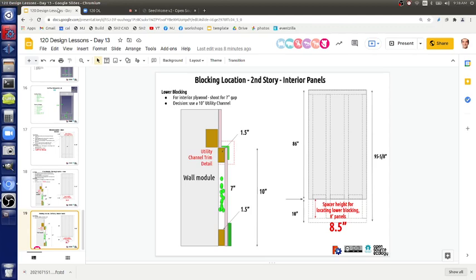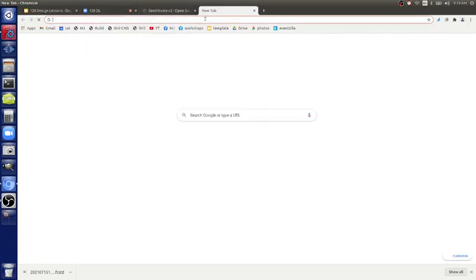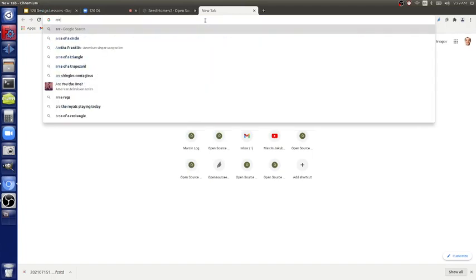Is that junction box just like a safety net to the outlet? The idea is that in electrical code, any connection has to be made within junction boxes for safety reasons. So you don't have loose wires and they're protected, a level of protection. They're somewhat insulated and fire protective as well.